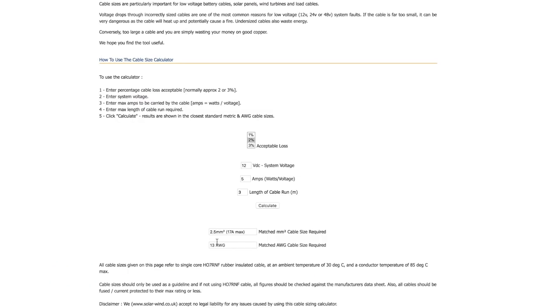The reason I say take this with a pinch of salt is: that cable was rated, I think it said up to 17 amps. Now I would run a similar cable for the fridge, but my fridge runs on a 30-amp fuse — this is where it gets tricky. You want your cable's amperage rating to be higher than that of the fuse, so that the fuse burns out before the cable burns out. With the fridge 3 metres away, if I run 12 AWG cable, the calculator says that's rated at about 41 amps — so with my 30-amp fuse, the fridge's fuse burns out before the cable does, and that's important to help prevent fires.